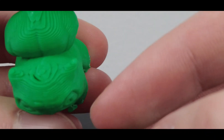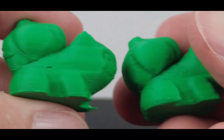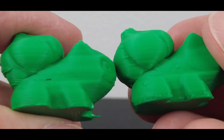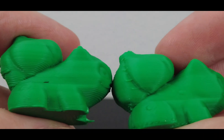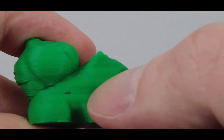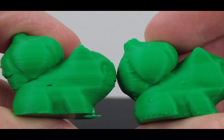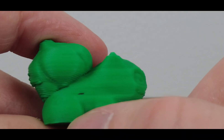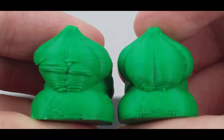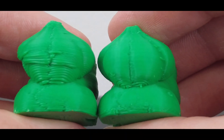On top of his head, it really didn't do very well — it's very flat on top. That probably would have been fixed with a higher infill. On the sides, honestly, it's really not as bad as I thought it would be. I thought it was going to have very little resolution. You can obviously tell each of the lines are thicker on the 0.8, but it still has all of the features — they're just a little less pronounced. Right here on his back, the bulb is not super great. I could have probably added some supports that could have potentially helped that.